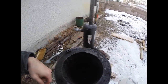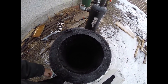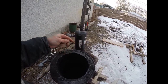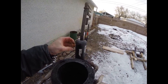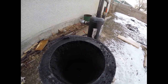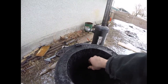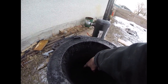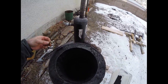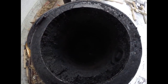I used a 10-inch standard pipe for my vessel. I drilled 10 one-inch holes in there, and on one side you weld a coupling so the air nozzle can screw in. If you're following this same plan, when you go to weld those on, put a nipple on there and make sure it lines up straight when you tack it in place before fully welding it.